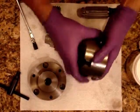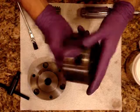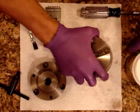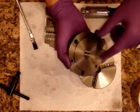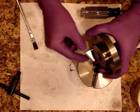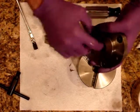Also, it's so heavy that once you get this thing turning, the momentum helps you kind of drive through cuts that the tag sometimes will stall out on with its smaller chuck. I don't think I had to tap the spindle — I do have a tap this size, but I think it was already tapped. I just had to cut part of the backing plate off because it was way too deep as I recall, and then I think I had to turn this inside here.